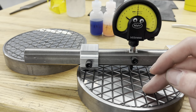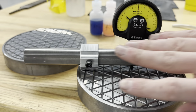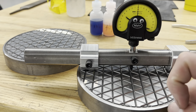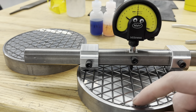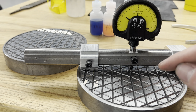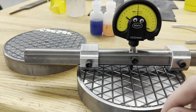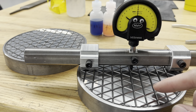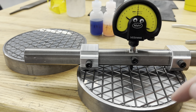That went through grinding and we got it pretty decent, but there's maybe a 40 millionths twist across the whole 12-inch length of it, and that's really tough to get out on our grinding setup. Even just a tiny amount of residual magnetism seems to pull the twist back when you set it on the mag chuck, even if the magnets are off, so you can't really grind it out as easily. So we figured maybe we can lap them in, and then I got back into the lapping plates, and now here we are.